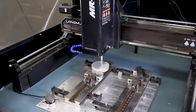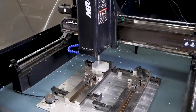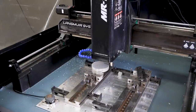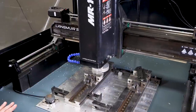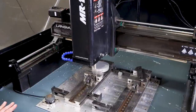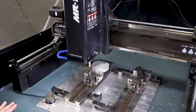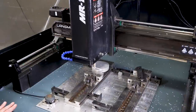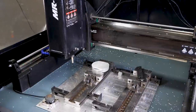Start making some chips. All right, so that's pretty good for that side. We'll come over here. The best machining direction is really climb milling. But for something like this, we're just gonna go ahead, since this mill is rigid with a good spindle. It pretty much likes anything at this speed. So, all right, that's pretty much the idea there.